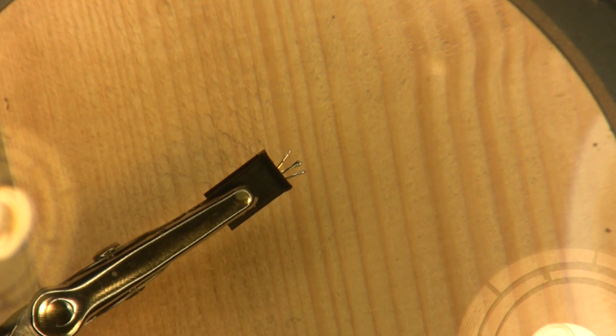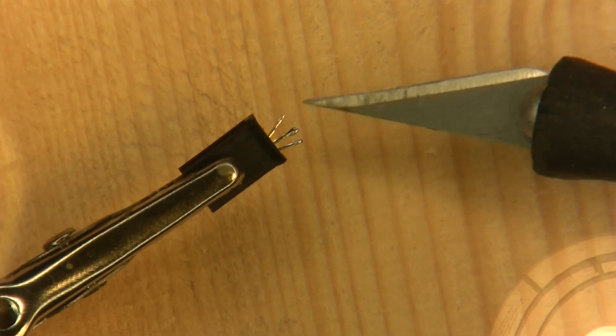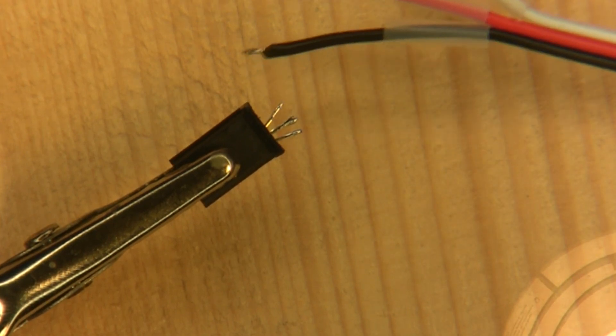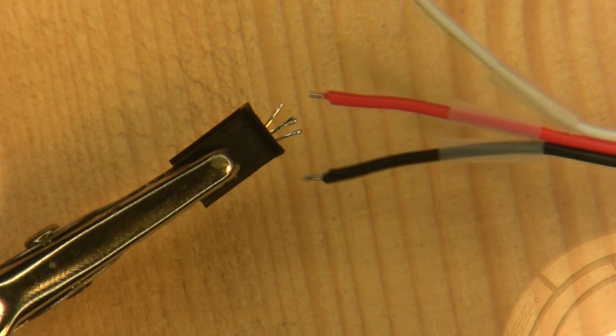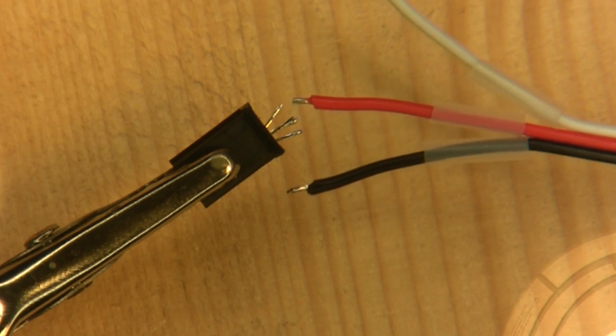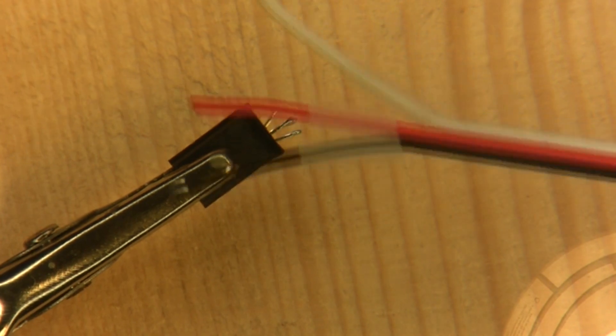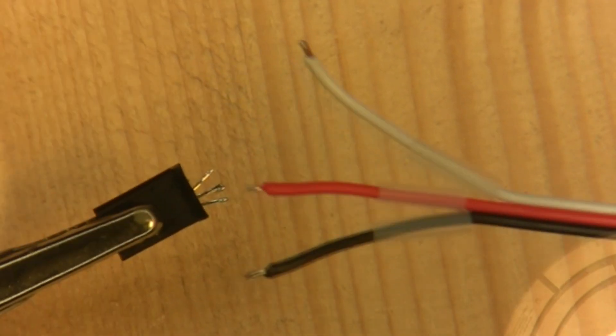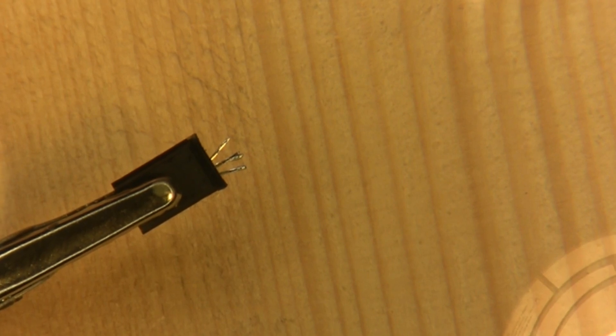Just to save time in the video, I pre-tinned these wires coming out of here — just put a little dab of very, very thin solder. I'm using real thin solder, just a little bit bigger than those wires. I tinned each one of those with just a little bit of solder. Then I've exposed just a small part of each one of my wires and tinned the ends of those too. So I basically just touch a small amount of heat to each connection and they should stick nicely. I've got little pieces of shrink tubing around there so that when I solder I can just wrap those around and put those on there nice and tight.